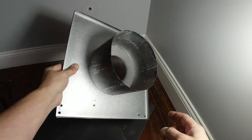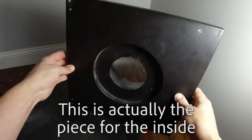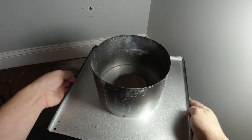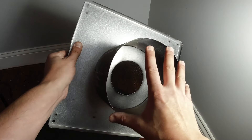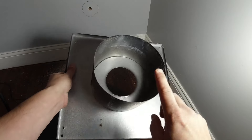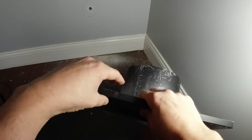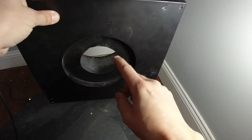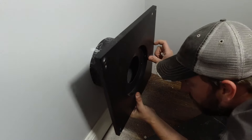Alright, we got our hole here. This is the piece that goes on the outside and attaches to the siding — or under the siding — and it's basically to keep any combustible materials from the heat. The smaller pipe goes right through here. This piece goes on the outside and then there's another one that goes on the inside. So I'm gonna take this one, mark it, hold that hole center, mark this and cut that out.